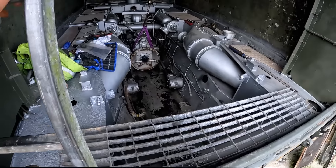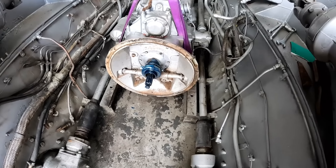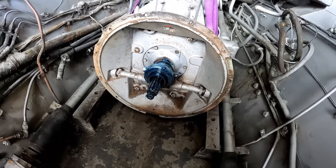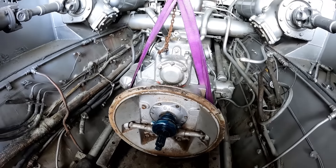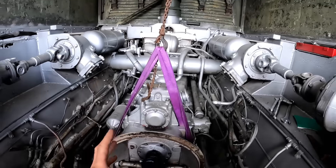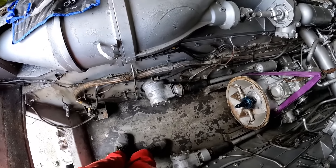Just have one last look in the back before it goes in. The bell housing is all fitted now to the converter plate and the clutch thrust bearing is all in place — I've greased it right up so the spline shaft will hopefully slide nicely into the clutch unit on the engine if it's all aligned right. Also, because this whole gearbox is actually hinged slightly, I've hooked up a little lever hoist here off the hiab so I can adjust the height of the whole thing if it's not quite aligned, which is really useful. With a bit of luck the engine will now slide straight in.